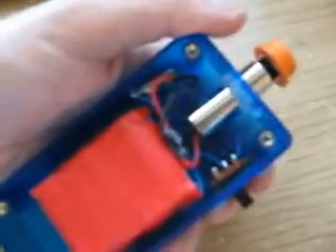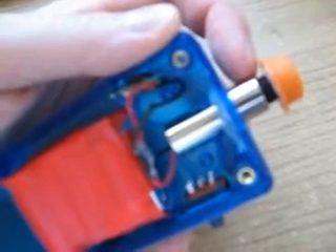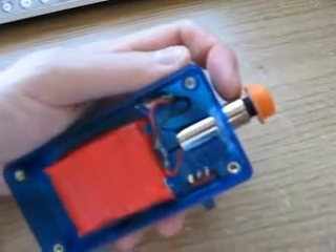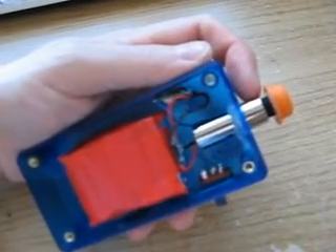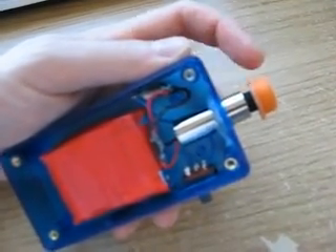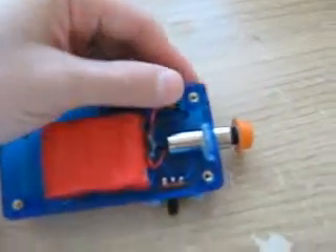The other difference in this setup compared to my previous one is that I'm using a glass lens. This glass lens has been coated to optimize its performance and compatibility with the red laser diode. With this glass lens, the beam comes out a lot clearer, it's a lot easier to focus, more distinct and sharper, and most importantly it allows more laser power out compared to the standard acrylic lens. This glass lens does provide quite a significant increase in power output.